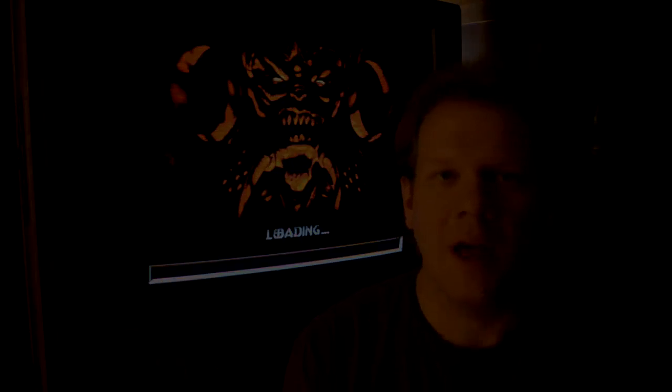Go online and study, then start working your way into practice. Pick up a consumer CRT and say: my goal is to learn everything about this consumer CRT. Take it apart and replace all the larger, older capacitors in it. Make a checklist of how to remove caps and go through that yourself. After you get done with that project, fire it up — it's a really great feeling knowing you completed it. Then you can take the next step: maybe RGB mod the TV, or get a broken PVM and try to fix it. That's just my advice.